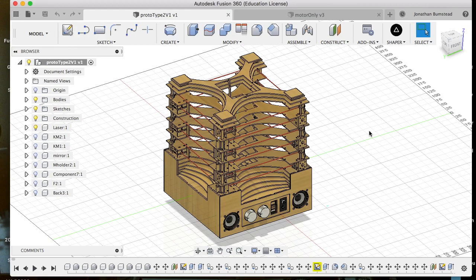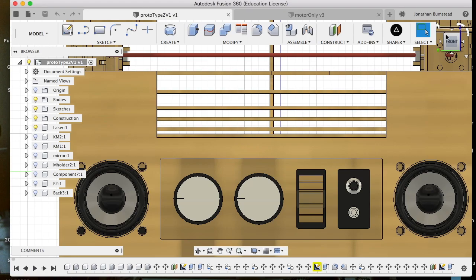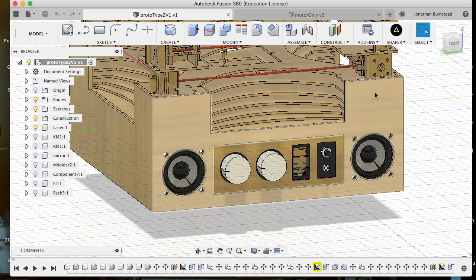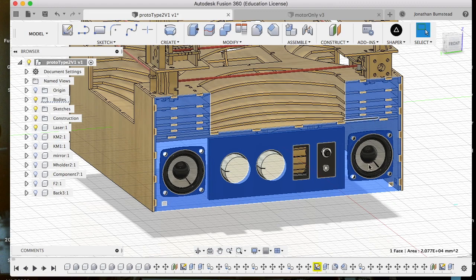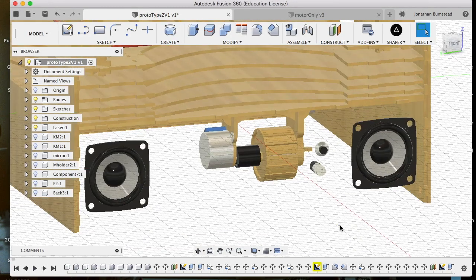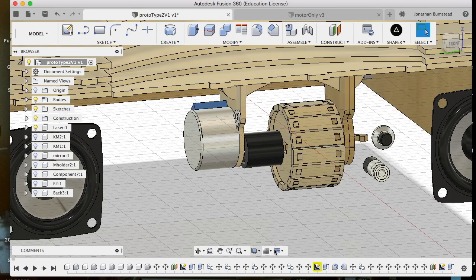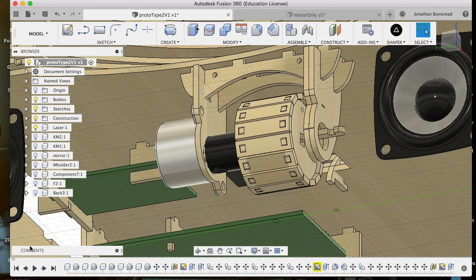There's one more sub-assembly I wanted to go over in detail: the instrument wheel, which you can see from the front. I'll remove some of these front panels so you can see how the bottom part is assembled. There are openings in this layer for the layers of the bottom to slide into. Behind these knobs is the potentiometer and the rotary switch. This instrument wheel displays the current instrument being played and is turned with the stepper motor. The position of the instrument wheel is determined using a Hall Effect sensor.